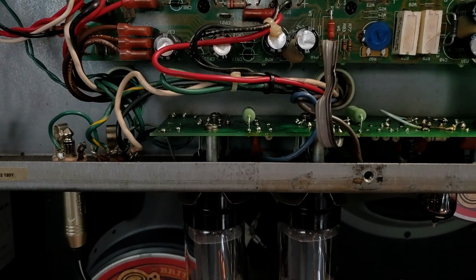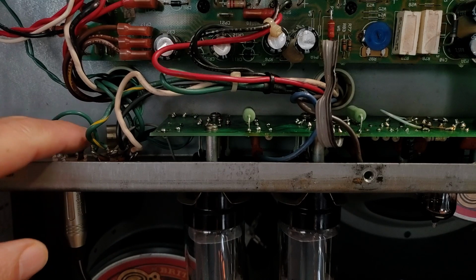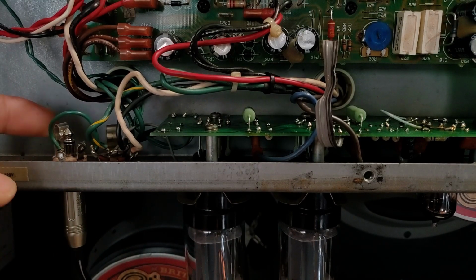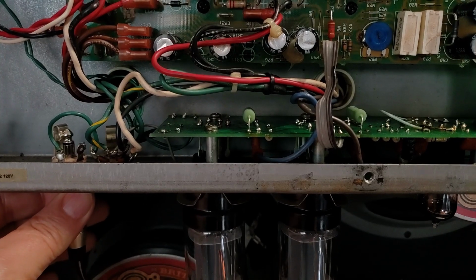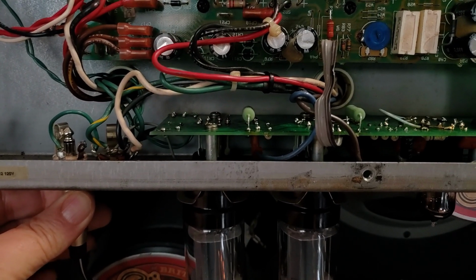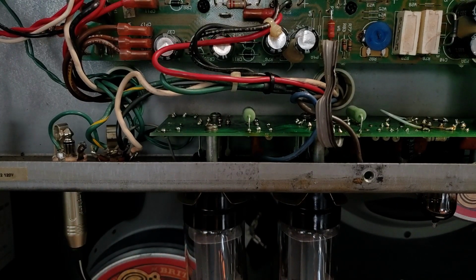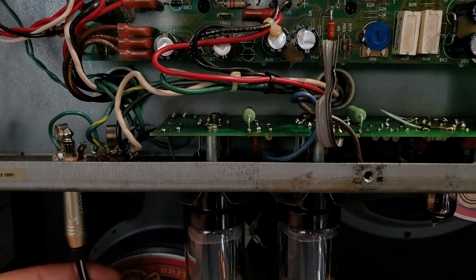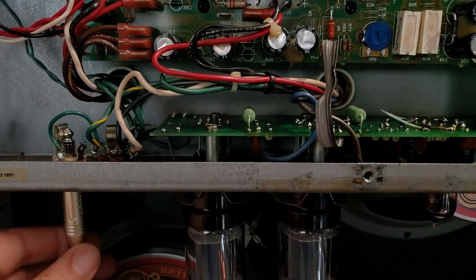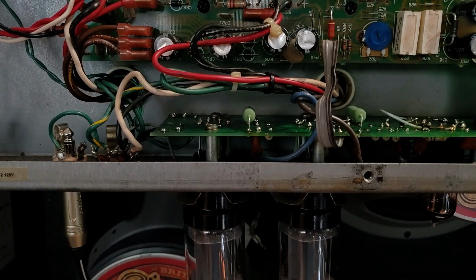speaker jack, and when it's out, it's grounded properly because the shunt is making contact with the tip again. And when it's in place, it's rock solid now. It's making real good contact. And on the first trip here, I didn't mention it before, but I also replaced the molded plastic speaker plug. I guess I did this probably when I did the speakers. I put in a Neutrik plug with some real speaker cable going to the new speakers.